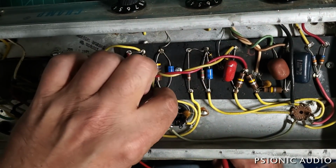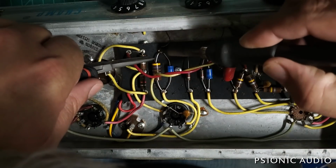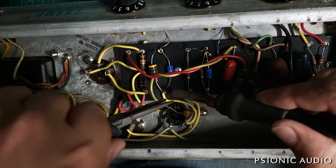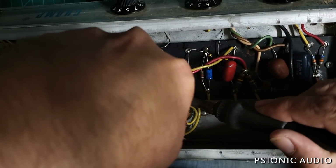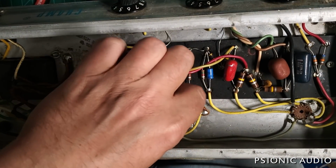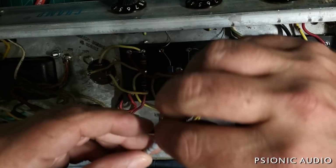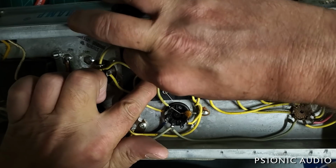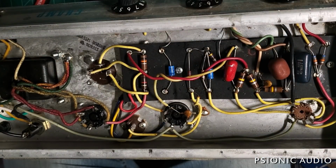All right, let's change out this cathode bypass cap here and the output. And that will be returned with the other original parts in the amp. And since I did not add a bunch of solder when I was putting it all back together, I don't have to take out a whole bunch again now. So, new 2 watt metal oxide. Should be pretty much ideal for the purpose.